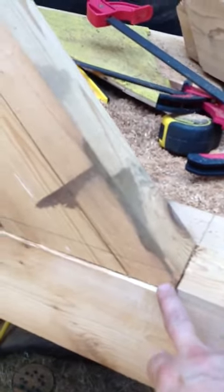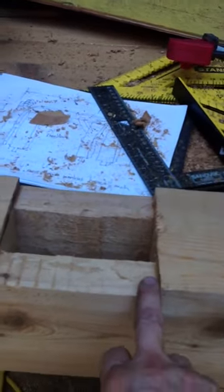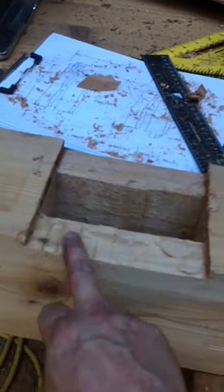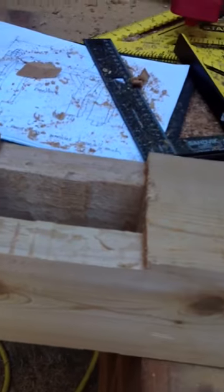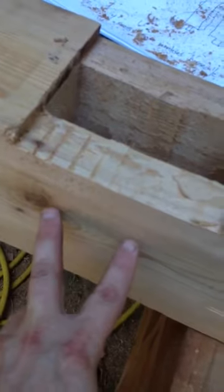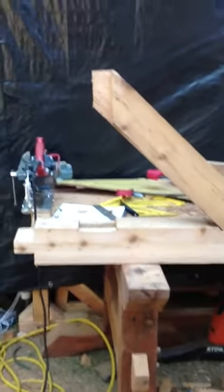right? Everything doesn't move. And of course, with the tenons pegged in here, it's very important to house your shoulders. These are called housings, and then these up here are called shoulders, and the shoulders are housed, which gives it all its strength. And then the pins, of course, that go right here hold everything together. And that is a mortise and tenon 45 degree knee brace post and beam.